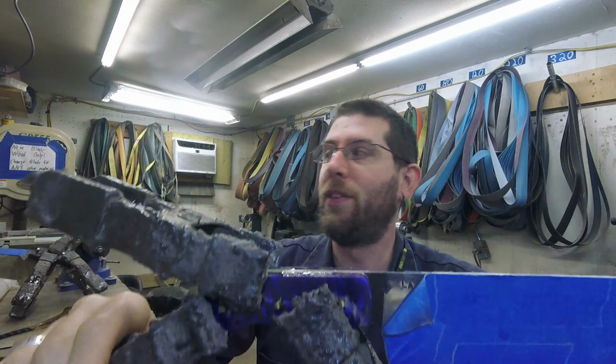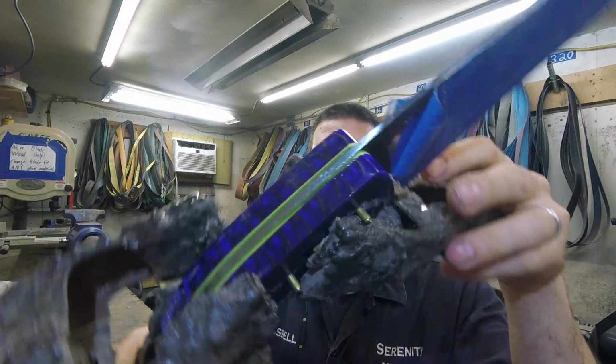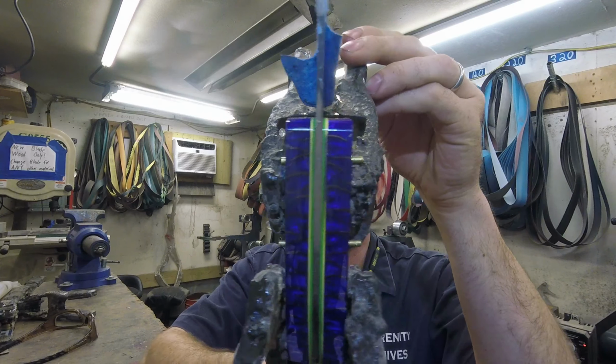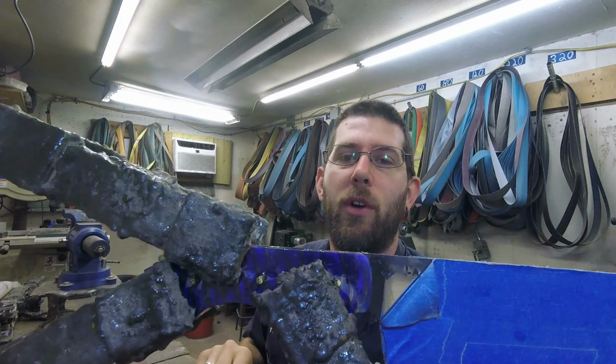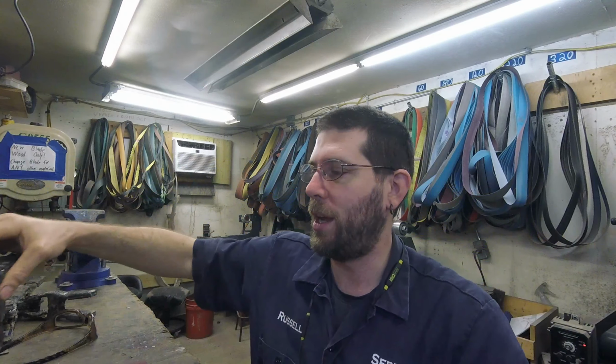Super stoked. And then I also got this beautiful LSU color theme knife ground and the handle on yesterday as well. So absolutely stoked by those two. I have the boning knife to grind on today. We do use a 24-hour epoxy, so I can't grind on these until later in the day. You can technically start grinding on it at about 12 hours.